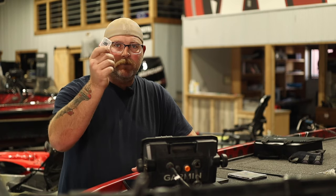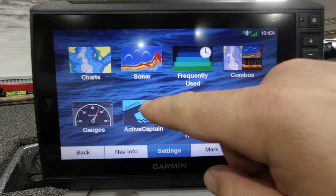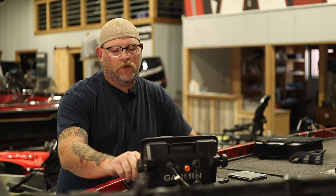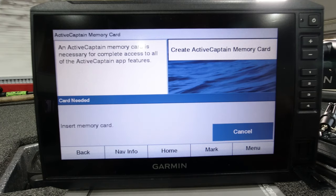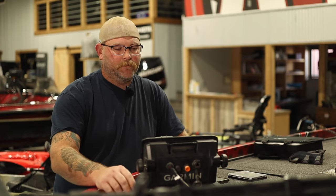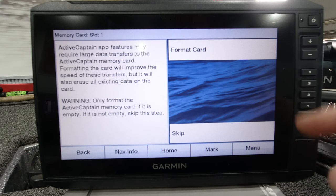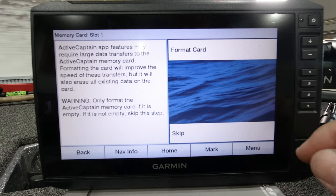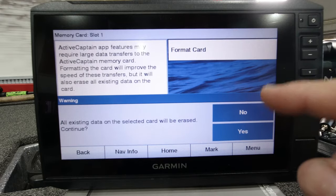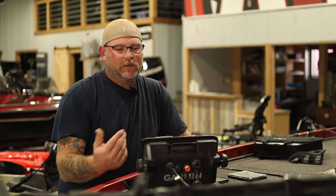To get started, we're going to need an empty fresh memory card and you're going to see why here in a second. Start with ActiveCaptain, go ahead and tap — it's going to tell you to create an ActiveCaptain memory card. This is something that we want to do to get going; we're going to need that so all the updates will stay. Go ahead and click it — it says insert memory card, put it in the unit. We order bulk 8 gig micro SD cards off of Amazon; you can find them on there at about the best price. If not, you can find them pretty much anywhere — Dollar General, Walgreens, Walmart, wherever. So the memory card is inserted and it's going to ask you about large data transfers and things like that, and you want to tell it to go ahead and format the card. This is really important — use a fresh empty memory card so you're not formatting and erasing other things. Format card. It warns you again: all existing data will be erased. Hit yes, and it's creating the card now.